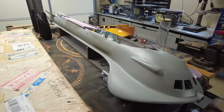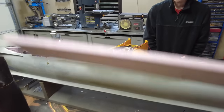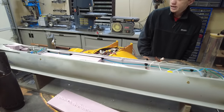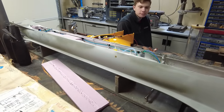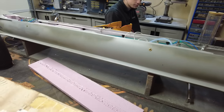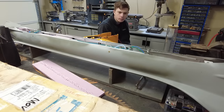First and foremost, if you are following my build blog for this 80-inch Sea View, you'll know we're having some challenges with the trimming of this boat. It is massively unstable in surface trim, reason being that the ballast tank is way down low in the bottom of the hull, which creates a nice force that wants to flip the boat upside down. I have brass stock on order to secure to the keel — about 5.7 pounds — and then we'll put in foam to offset it. It will be interesting to see what it does to the waterline, but we need to compromise that to gain stability. Right now I can float it at the correct waterline, but it will be listing left and right.